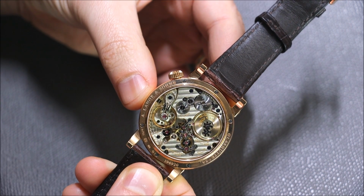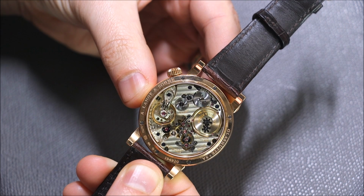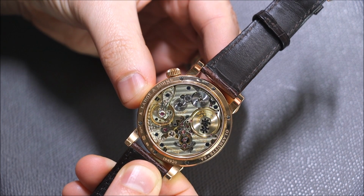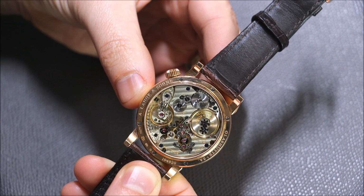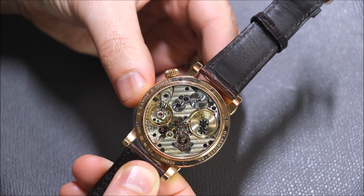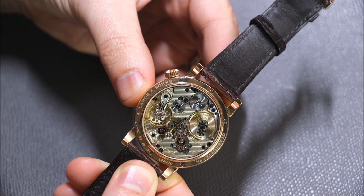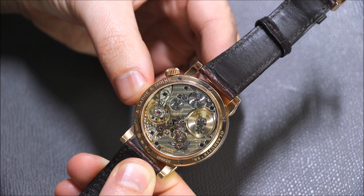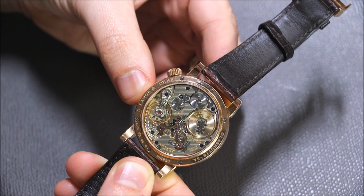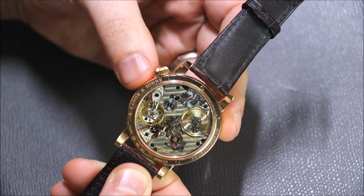And what's special about it is that unlike brass, it does not need to be rhodium plated or coated or anything like that in order not to tarnish. Most watch movements are primarily brass, and in order to not tarnish, they need to have a coating process because untreated brass will tarnish. German silver does not. And what that means is because it can be unfinished, you can polish it really nicely.